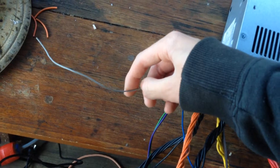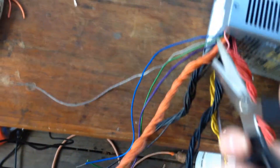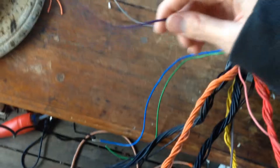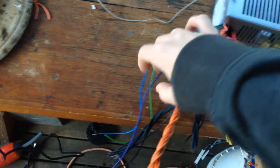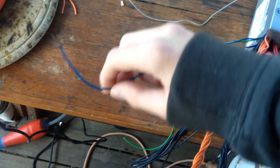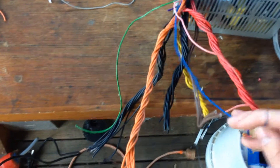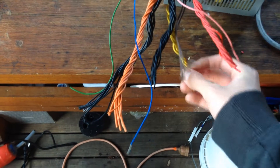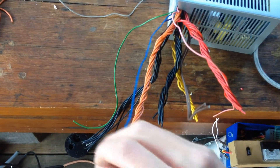There's the grey wire. The grey wire is just a little signal wire to tell you whether the power supply is working or not — you can probably just snip that one off. It's also the purple one, which even when the power supply is turned off will still provide 5 volts for any on-switch circuitry, so you won't actually need that one either — snip that one off. Your blue wire, you can decide whether you want that one. That's the minus 12 volts, but that can only supply probably a maximum of 150 milliamps. I'm going to use it because you can use the minus 12 volts and the 12 volt pin together to get 24 volts, but generally you might want to just snip this wire off.